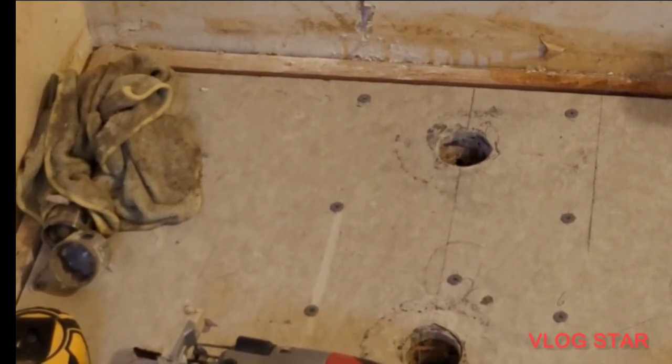All right, now, how to lay out for your vessel sink plumbing. I hope this was helpful. How to lay out for your vessel sink plumbing and drill and cut your holes and all that. So these vessel sinks can be challenging if you don't know where to start. How do you get center? How do you get a hole? What happens if you come up against a wall you can't drill? Well, now you know. You can work your drill bit back and forth and work the edge, drill your holes as close together as possible, and use your drill bit to cut between the holes, that little space of wood between them. You just need a 1/4 inch or bigger drill bit for that.